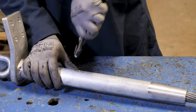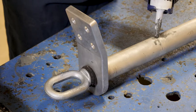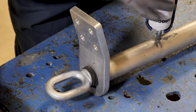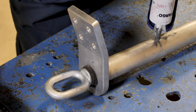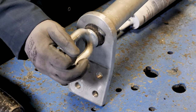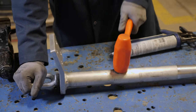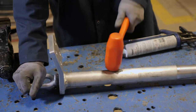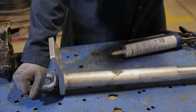Slide the aluminum dead-end body over the steel dead-end until snugly against the felt washer and forging eye collar. Remove and set aside the dead-end body filler port plug. With a caulking gun, inject Fargo UJC or HTJC through the filler hole until compound begins to flow out between the aluminum body and the felt washer. Hammer the aluminum plug into the filler hole, then cut or file off any excess length of the pin flush with the aluminum barrel if needed.